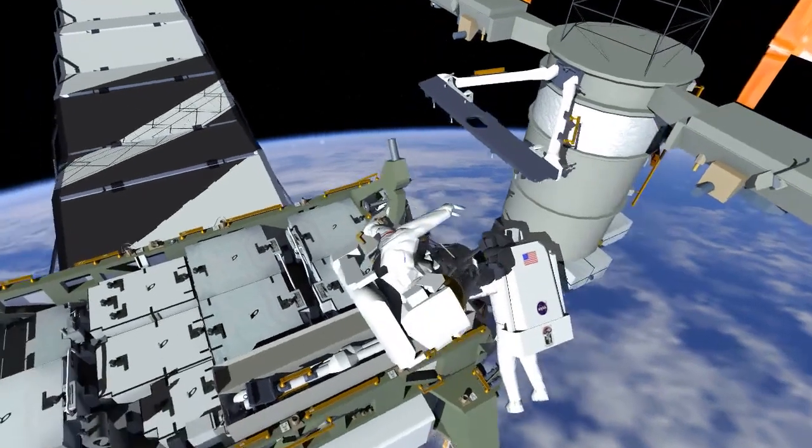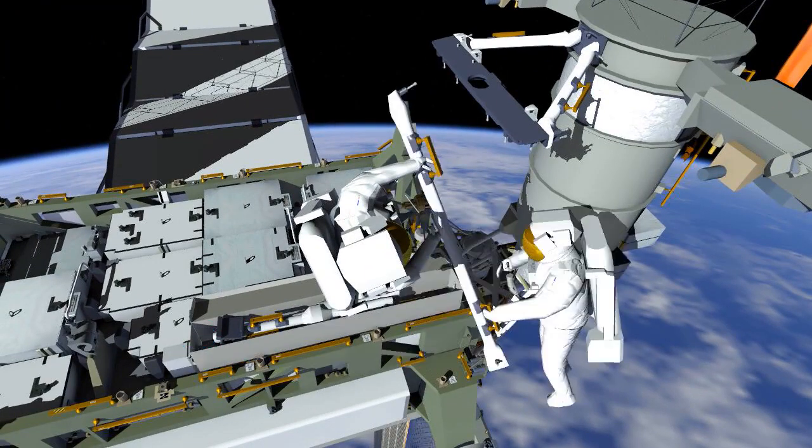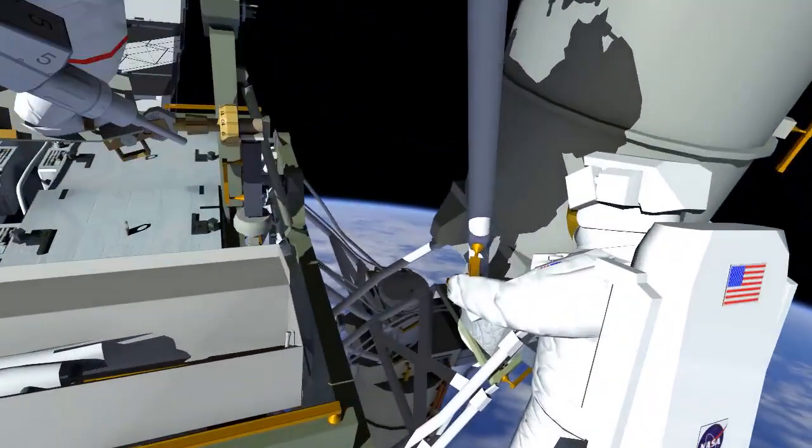By installing the right lower strut, the system is now in a good configuration to leave it out and operate space station nominally. If we didn't have this installed, we would need to perform a tie down to make sure that everything was structurally sound before heading back in.